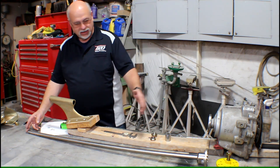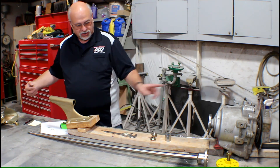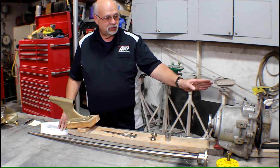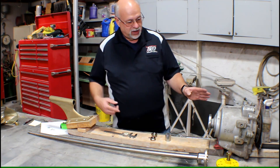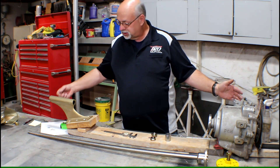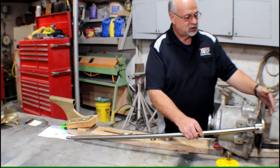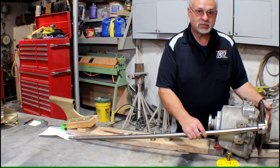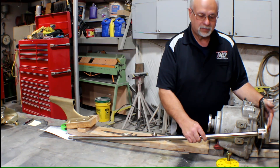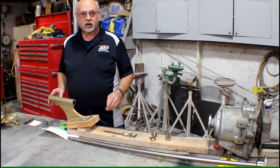That's the same result as when we measured the shaft — 47 and three quarters — but this is the preferred method, sending that tape through the boat. Now if you have a V-drive pass-through where the shaft goes through the transmission and comes out the front end, it's the same theory. You send that tape measure clear through the transmission, hook it on the machined face of the transmission coupling, measure all the way back to the strut, then add our four and three quarter inches.